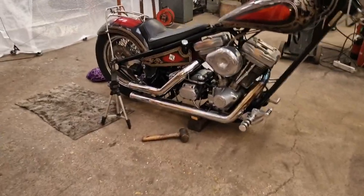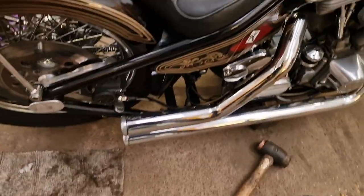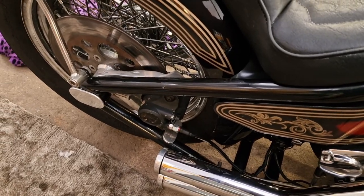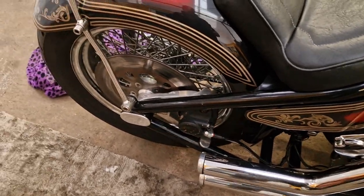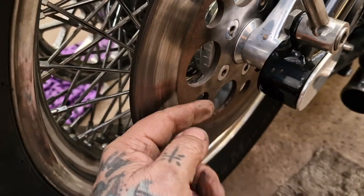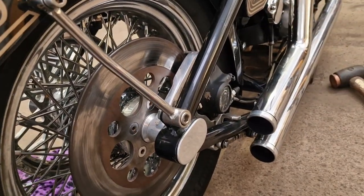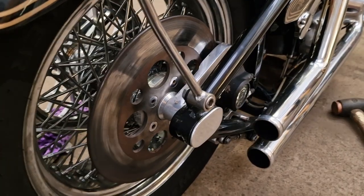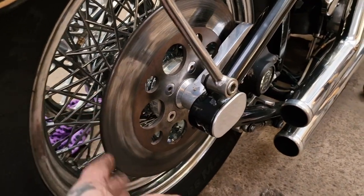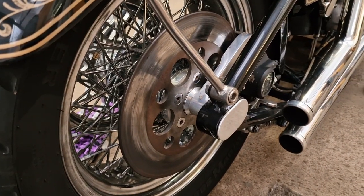Next up we've got Mickey's. We're going to look at this disc that's fucking warped and it's throwing his caliper off. It's dished out - put a straight edge along here and this goes away from it, and it's not even equal, it's proper bent out of shape. So I've got the unenviable task of getting it all apart, putting a straight flat disc on, seeing how the caliper sits, and then making adjustments to the spacing if needs be. So let's get this all stripped out.